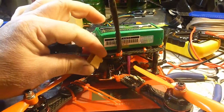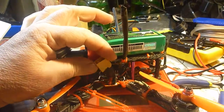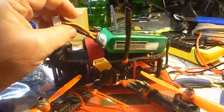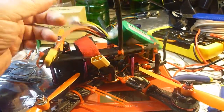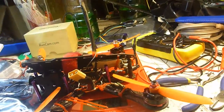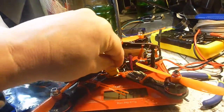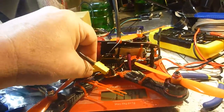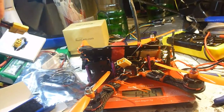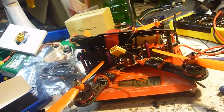One of the other mods I've done is stuck some wire on the XT60 connector. This way, when the battery goes flying in a good crash, this part here won't rip the XT60 connector that's anchored to the board. It'll straighten itself out, this cord, and then unplug itself, rather than trying to rip the XT60 connector off the board.